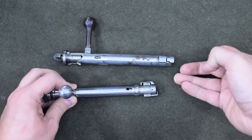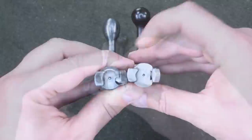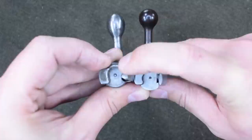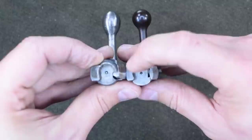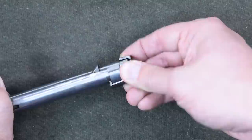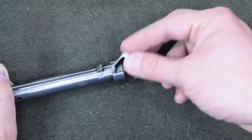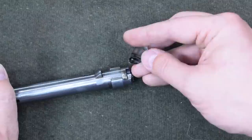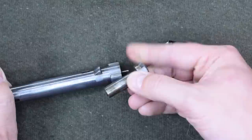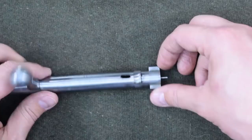There's the same little hole, and of course you'd allow gas to enter through the firing pin channel as well. On the bolt faces, the Type 35 has an overhead lip — probably an attempt at a gas check but also an attempt to ensure a nice positive controlled feed right from the beginning. This reminds me of some intermediary Mausers attempting a better feed before the full-length extractor was developed. As for disassembly, we start the same way as the Type 30 by rotating the bolt face and wiggling it free. The extractor is now pinned to the front of the bolt face rather than in a dovetail — so once it turns over, he's free.